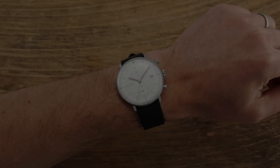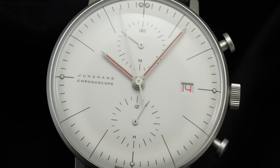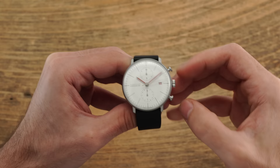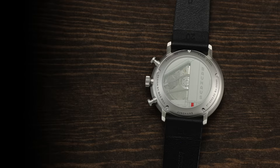One point of consideration for the Valjoux is its thickness — around 8 millimeters for the movement alone — which is why watches featuring a Valjoux caliber typically fall in the 13.5 to 15mm thickness range when fully cased up. Also, do not be alarmed if you feel movement from the rotor when wearing this watch; Valjoux movements are known for having a louder rotor. The movement is cam-actuated, with start/stop at the two o'clock pusher and reset at four o'clock. For the model on display, we tested accuracy across five positions, running at plus six to plus nine seconds per day.